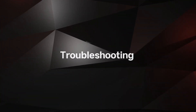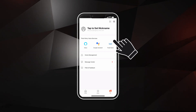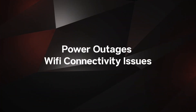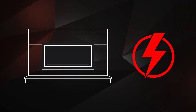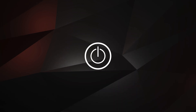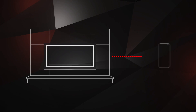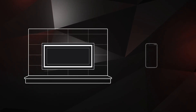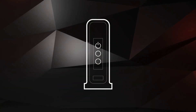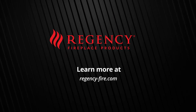If you are having problems pairing your fireplace, please clear the cache in the app. From the home screen, go to Me. Tap the settings icon in the upper right corner and select Clear Cache. If the unit is on but power was disconnected during a power outage, press the Wi-Fi button once to connect again after the power has been restored. If the unit was turned off for maintenance or other reasons, turn the unit back on, then press the Wi-Fi button one time to connect again. If your cell phone Wi-Fi disconnects, the fireplace will remember your phone — simply reconnect to the fireplace. If your home Wi-Fi disconnects, you will need to reset the unit and re-pair your phone to the unit. For more information about the app, visit regency-fire.com.